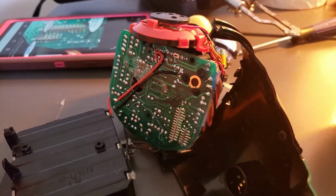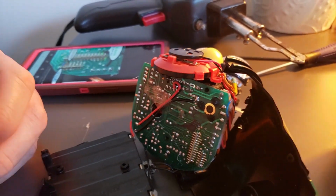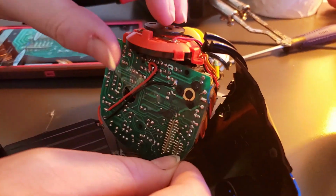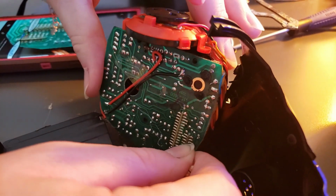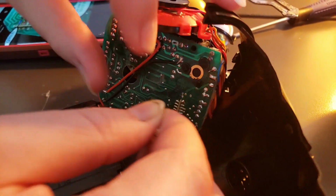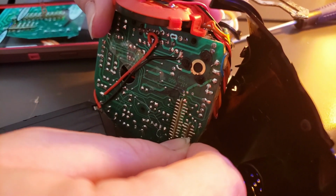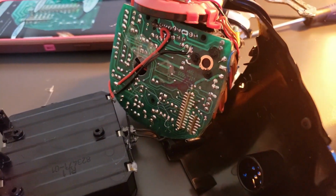Alright, so messing around with this, I came up with this resistor. Now this is only a 2.7K, but it's going to extend the life of the instrument, and that's really what we're going for: the best effect and the longest life possible. So when we go here, you can see it is glitching out. So 2.7K still gives us that effect.